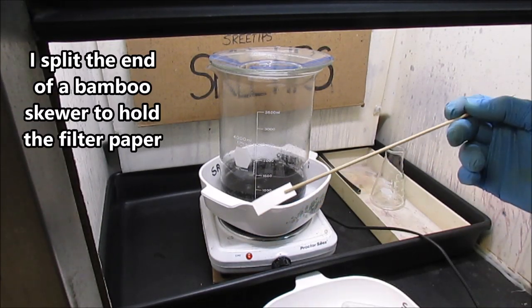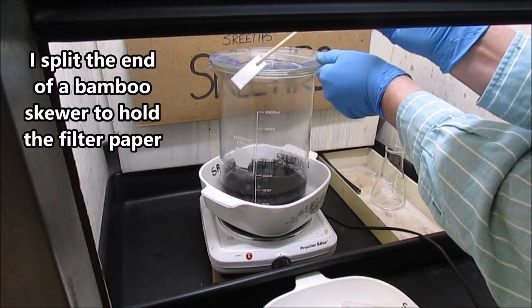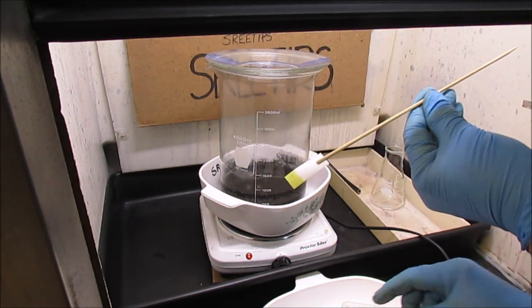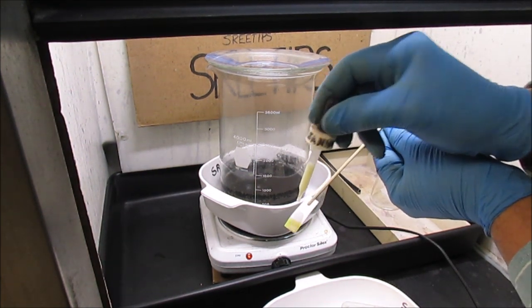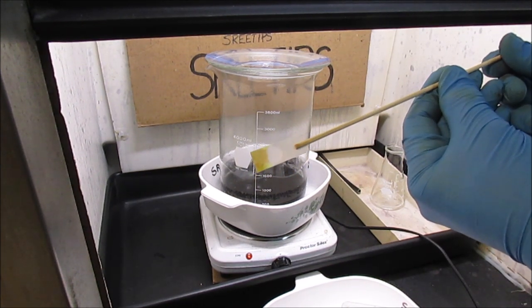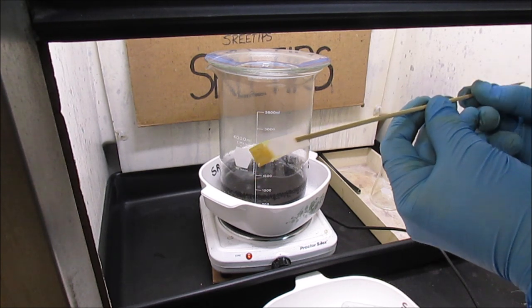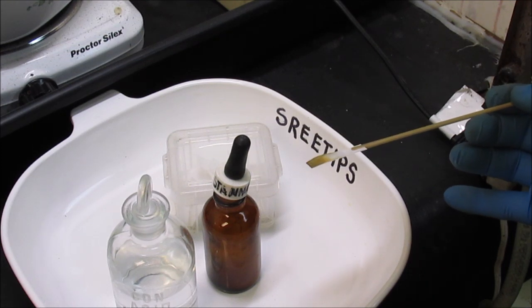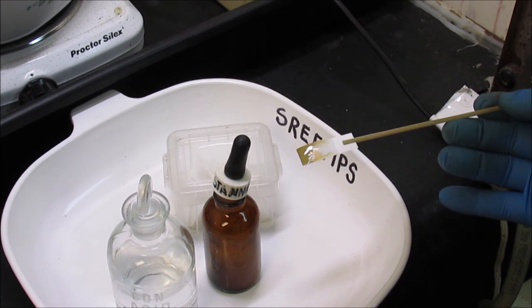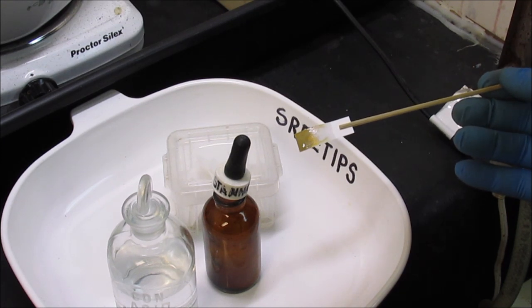This has been on cooking now for about an hour and a half. I'm going to reach down in there and get a little bit of the solution on this piece of filter paper here — it's looking the right color. Put some stannous chloride testing solution on it now, and bang — as you can see, that's orange, that's platinum. We've got platinum going into solution. This is a full minute after I took the test and I've got orange for platinum, and then I'm getting a little bit of brown-green color — that would be a positive test for palladium. So I've got platinum and palladium in solution.